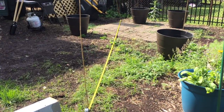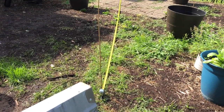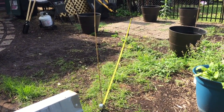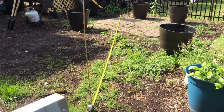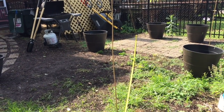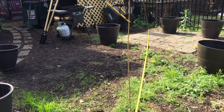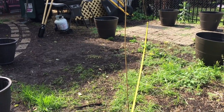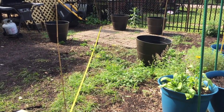Now, I'm not saying I've laid this tape measure down perfectly along the hypotenuse. Plus, there are a few weeds in the way, and maybe a little bit of a mound in the middle that might be contributing to the length. But with 226 on one and 228 on this one, being off by about 5 inches is a thing, but I think the ultimate diameter of the hole being between 9 and 11 inches is going to accommodate the hypotenuse being off a little bit. So I might have to dig the holes a little extra large around to set the posts properly.